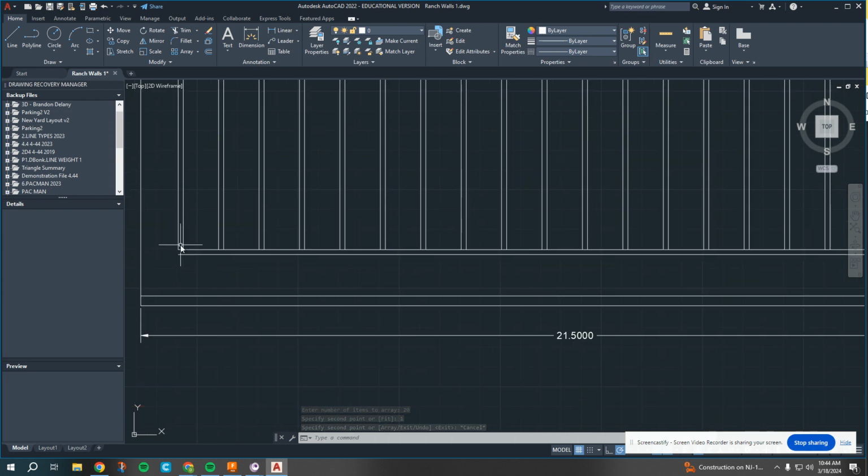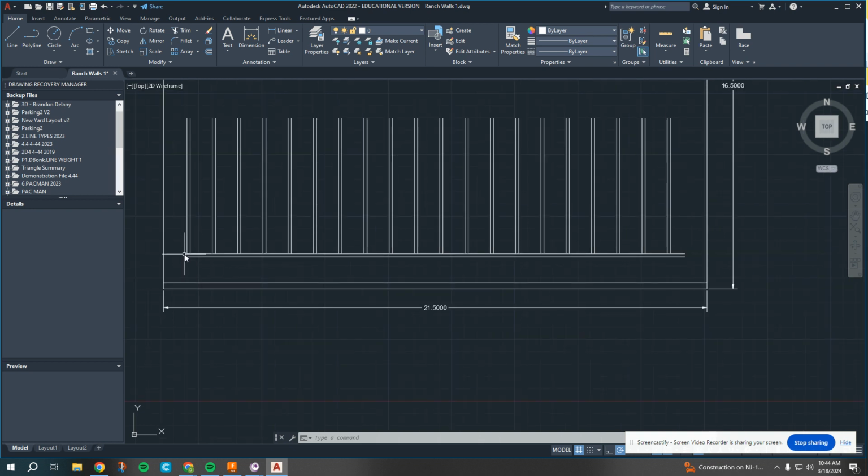So what you've got is, from the beginning of one to the beginning of the next is an inch. In reality, studs are spaced every 16 inches this way. And when you lay out a wall, you plan it out looking at it like this, where you have all the studs, and then you're going to piece in the rest of the components.